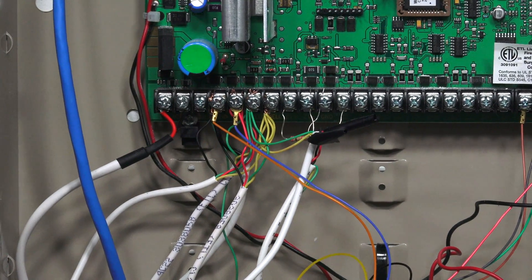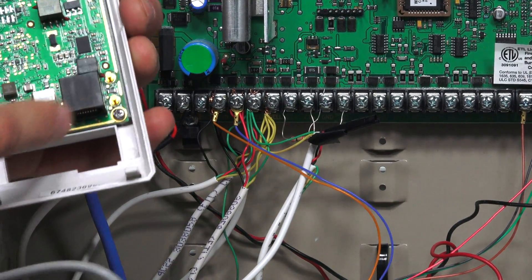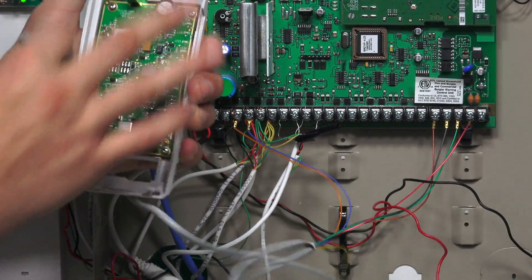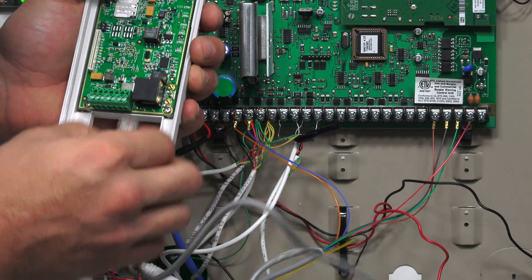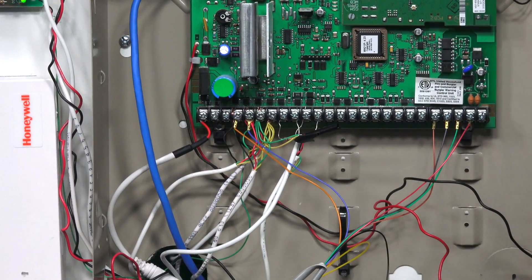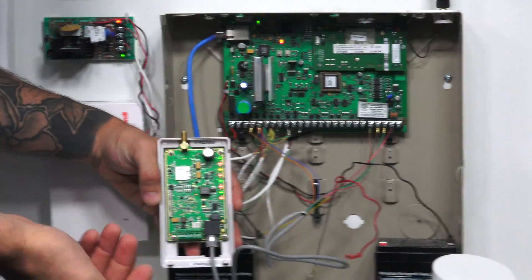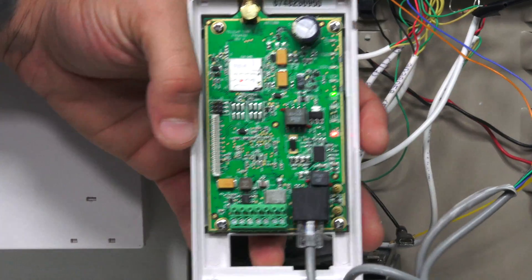So now we should be all set up. On the other end of our RJ cable, you can see there's a mod plug port right in our TelGuard where this plugs in. You want to slip the cable in the back and then plug it in so you can put the cover on, but I want to show you what the lights look like, so I'm going to plug this in with the cover off — it's just like a regular ethernet cable. We're all plugged in, and now we just have to give power to our VISTA system. As you can see, our TelGuard does have lights, it is coming on, and it's going to go through its boot-up process, and you'll be able to start setting it up and get it ready for activation.